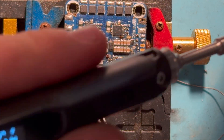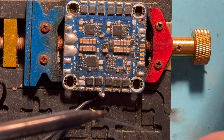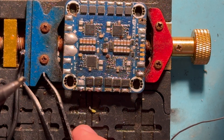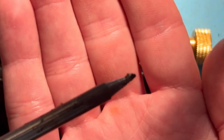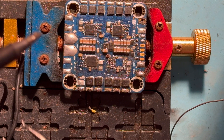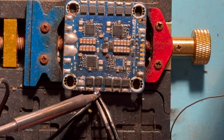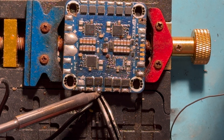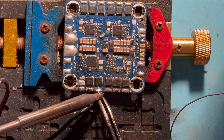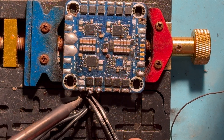All the heat is escaping out to the motors through all the wiring, so when you're working on a full setup just be patient. Make sure you're on the hottest setting, make sure you've got a nice little ball of solder on the end. The more surface area of the iron you can get onto the wire the better. I kinda have it up the side — it's not just on the tip, it's on the side too. You kinda end up kissing the side of the wire. As I want it to heat up more I'm going deeper on the iron, using more of the side to heat it. Or if I want a little less heating I could just use the tip.